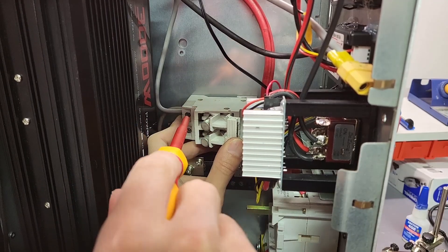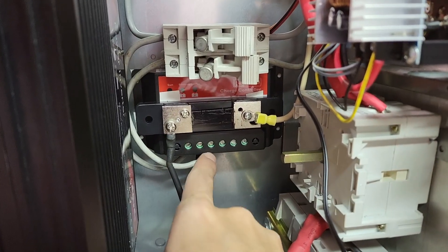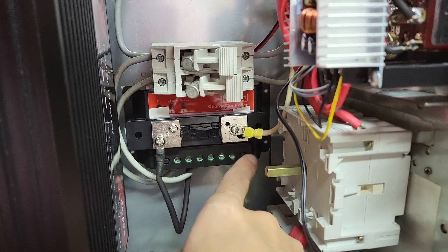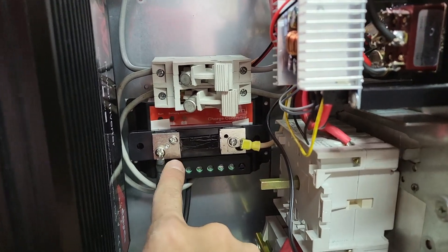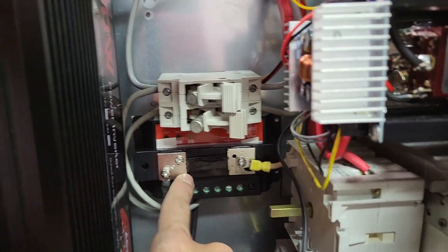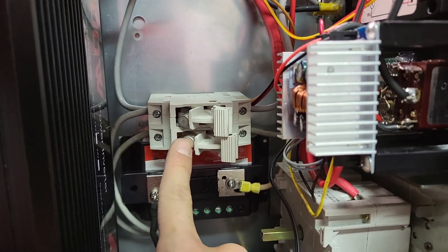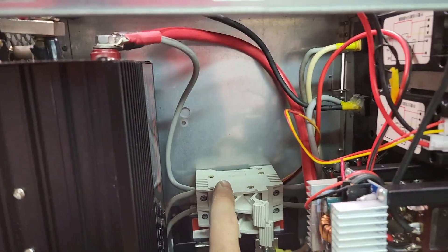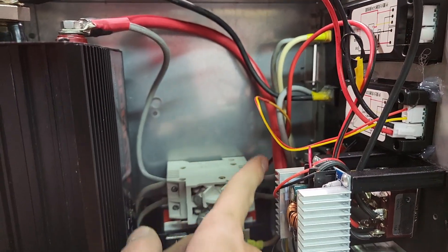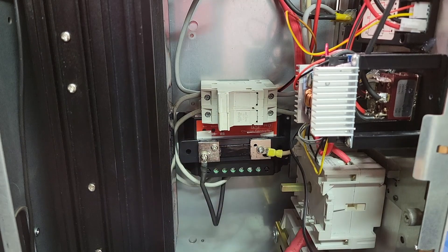Now I just need to connect the battery charging system. For charging I use a dedicated charge controller, which I need to wire up. On the input side it's connected to a shunt resistor to measure up to 20 amps, and on the output side it connects to the batteries through a fuse panel. Underneath I've installed the charge controllers and the shunt that measures how much current I'm pulling from the solar panels, and up here you can see the fuses.